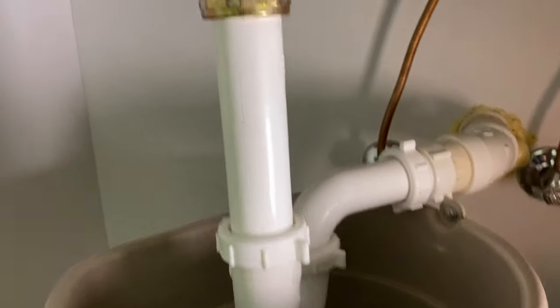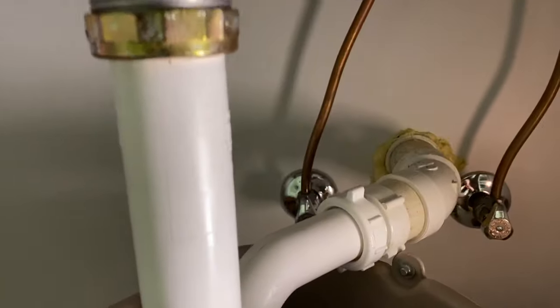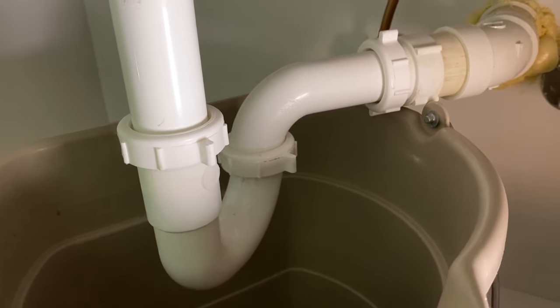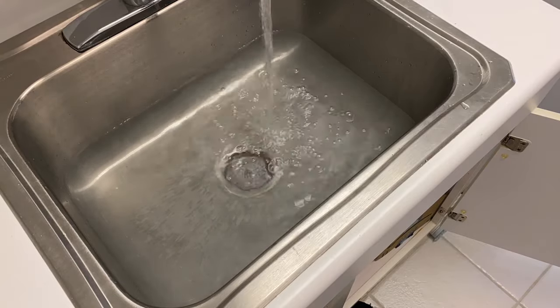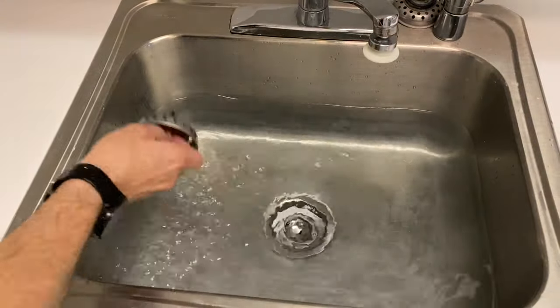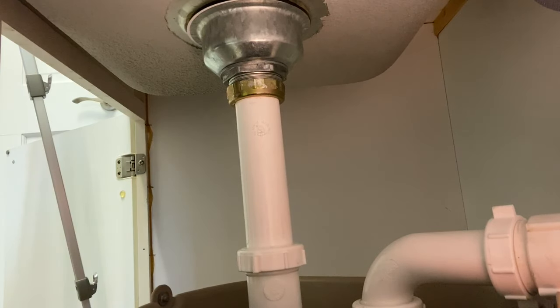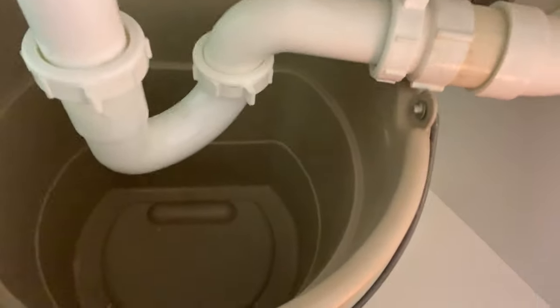The most important step is checking your work. Test one: turn on the water and go under the sink checking for any slow leaks or drips from all the connections — the strainer, the tail piece, and around the P-trap. Having that bucket there helps you easily hear any drips. Test two: fill the sink at least halfway to get both head pressure and high flow volume, then go below and check around all the parts for any leaks.